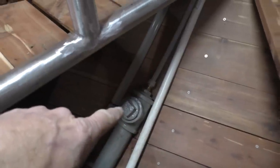So that's where it's easy to fill, but there's a hose that runs on up the wall to another tank up there. That's our head pressure. And we'll always want a little fluid in that tank because we always want the hose to have some fluid in it. That provides pressure. You get about a half PSI for every foot of elevation. So that's about 6 feet above the engine, so 3 PSI.